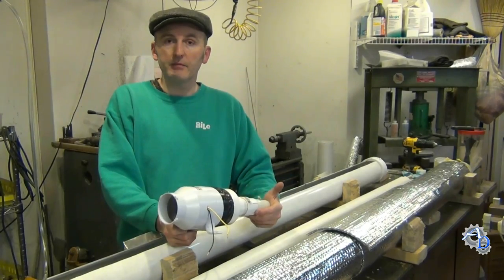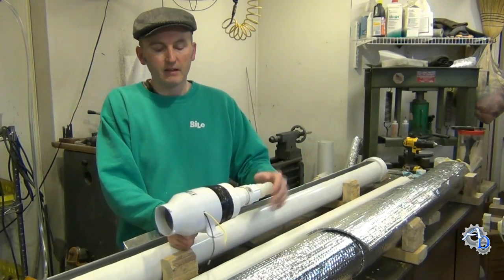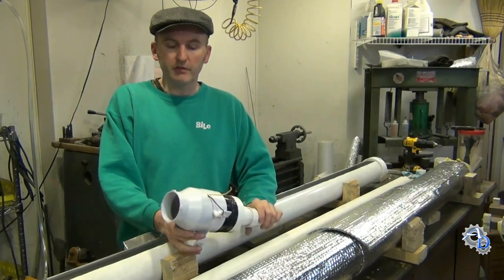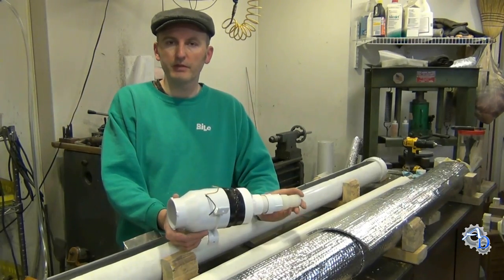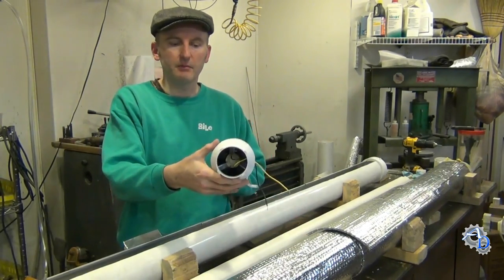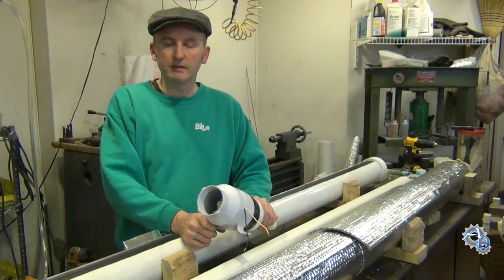You need to get rid of that because it's bad for your lungs, first of all, and second of all, it rusts everything about instantly in your shop. So I came up with a very simple fume extractor. I had a boat bilge blower laying around for another project from a few years ago. It's just a 12 volt axial fan setup that is used to take fumes out of the hull of a boat.